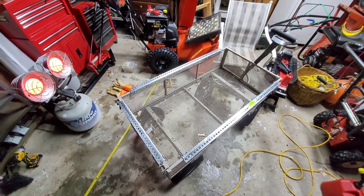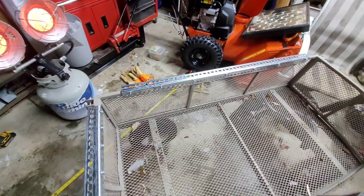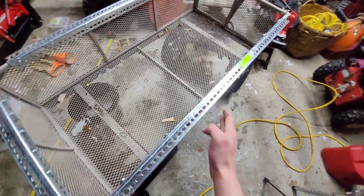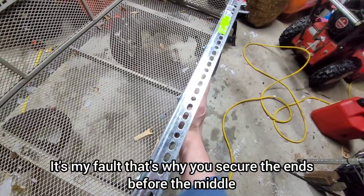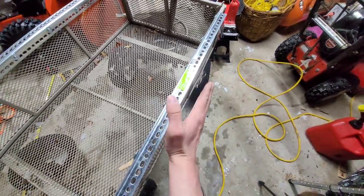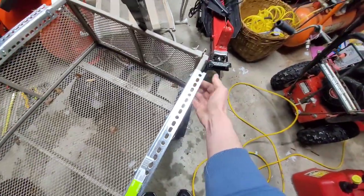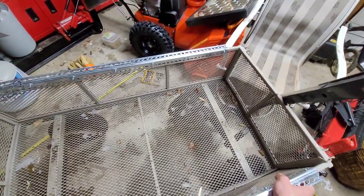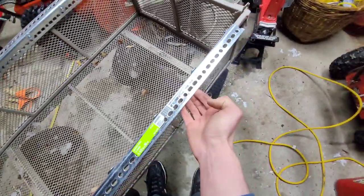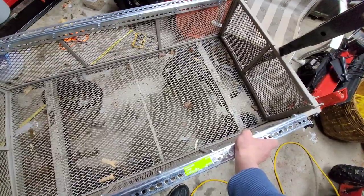The railings on this wagon are nice and reinforced now. I think this actually looks really cool. That one went along really smoothly, but you saw in the time-lapse I had issues with this one because it's very bent. So as I'm screwing it in, I have to hold it tight together. Then when I got down here, I had to pull a few back out because I noticed that not only is it crooked this way, but it's also crooked downwards. So I had to push down on the angle iron to get it to line up correctly. Out of all of these, I only stripped one of them — that's because I torqued it a little bit too much. Because on the other side of this thick stuff, this is pretty thin, the actual cart. So as it continues to break over time, I'm just going to keep fixing it until I determine it's a total loss.